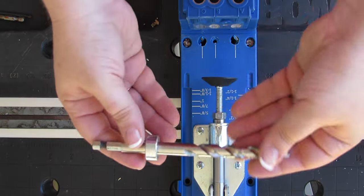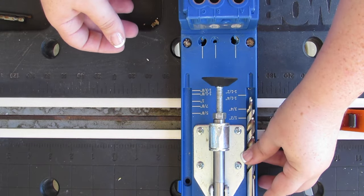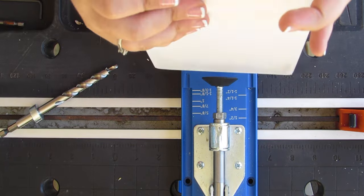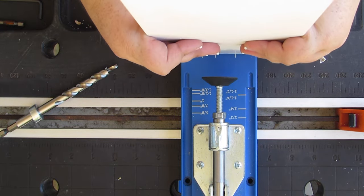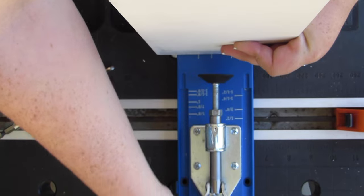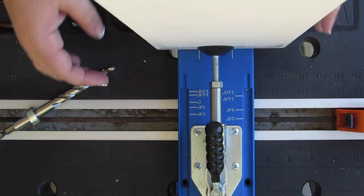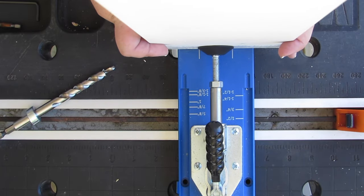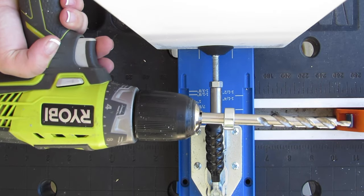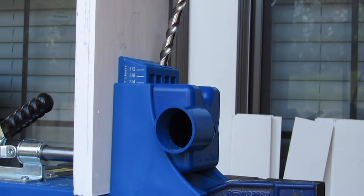I had all of my straight cuts done at the store, and then I took them home to put together. The full cut list will be down in the description. We're going to jump right into making these pocket holes. As you can see, we're using 3/4 inch wood, and I'm just setting up the Kreg jig for that. If you need help setting up your Kreg jig, I have a whole video on that, and I'll link that below. This is just a quick overview, setting up the bit and setting up the dimensions for the wood. Now we're going to get started.